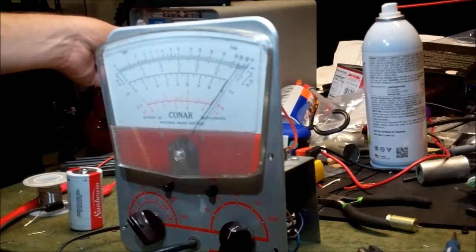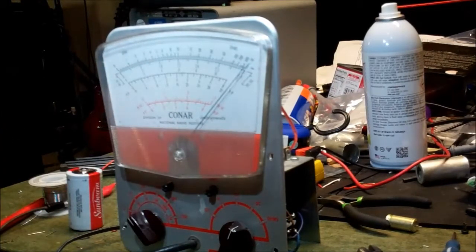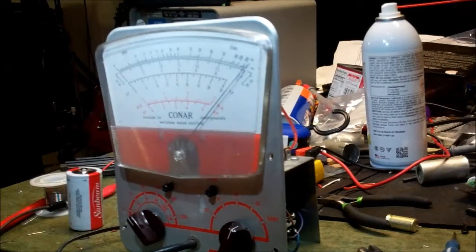Go up a little bit to 12. This meter says 12 volts. The adjustment pot inside of this power supply can be a little janky. So this is not luxury lab equipment. This is crap we bought at the surplus store. Okay, this is not Mr. Carlson's lab. This is Mr. V's pile of crap. And according to my new DMM, that is 11.99 volts. It says 12 on here and 11.99 there. So I'm feeling fairly good that our volts DC is okay now.